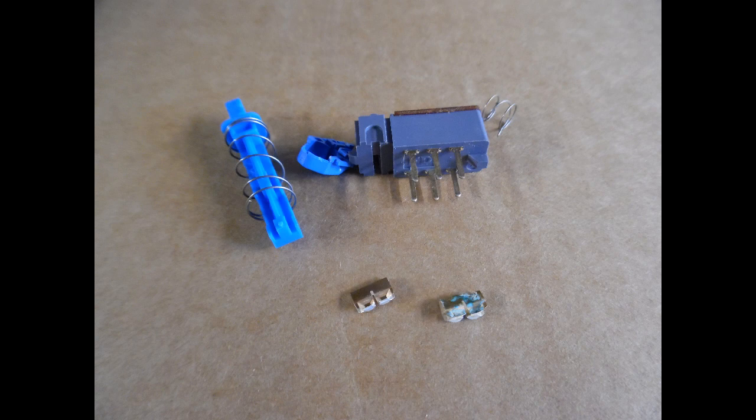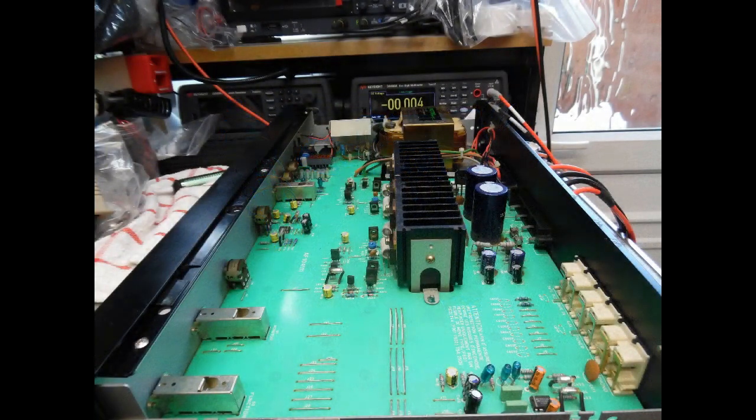The dust and dirt that fills into switch contacts can cause intermittent loss of sound. You may also find intermittent loss on the volume controls or balance controls as well. Unlike Technics amplifiers where the switches tend to corrode, on the Rotels you don't see that even if you strip apart the switch. Normally, applying DeOxit and operating the switches and potentiometers many times is sufficient.